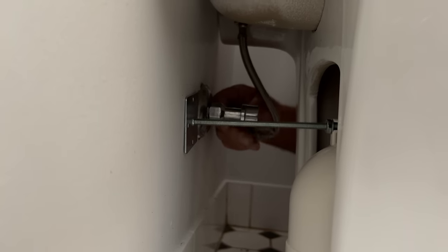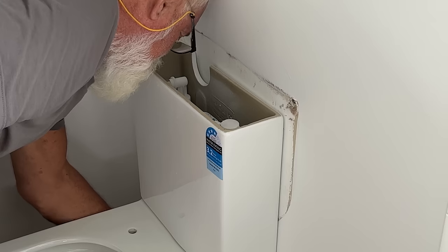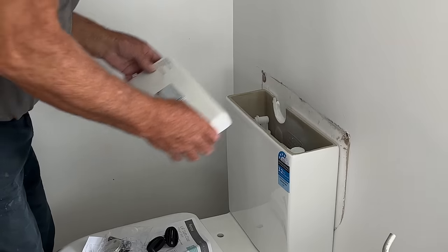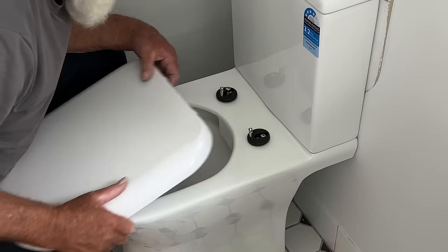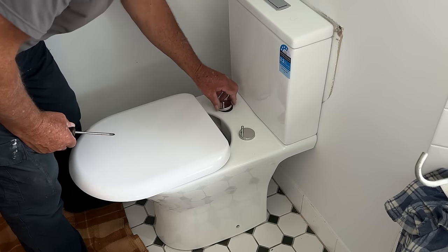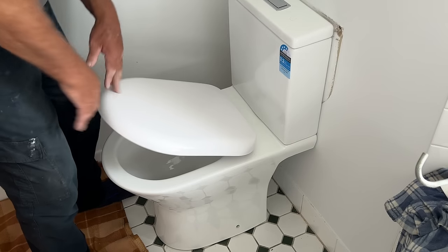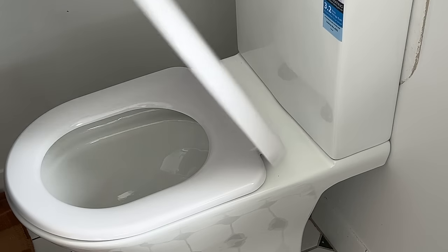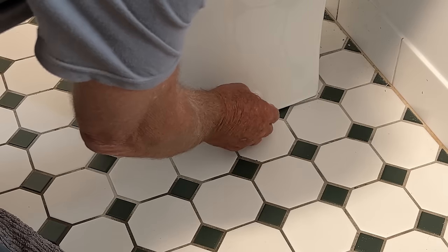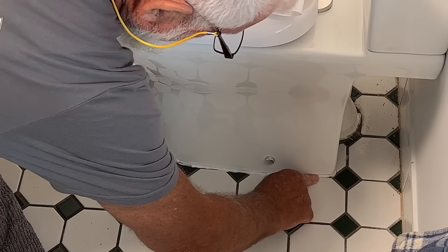Once we're happy there are no leaks, we wrestle in the small space behind the toilet and connect that water inlet hose — it's such an awkward spot. We reattach the inlet connection, then turn the valve on to test that the tank is filling and stopping where it should. We place the cap on top of the cistern and then install the toilet seat. Each brand is slightly different with its own idiosyncrasies; we just follow the instructions that came with the toilet. This is a nice soft-close toilet seat. We didn't use the support screws but we did pop a little bit of silicone in there, and the cap's on. Lee then ran a bead of silicone around the toilet bowl.